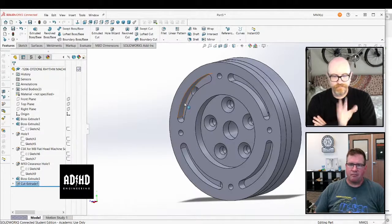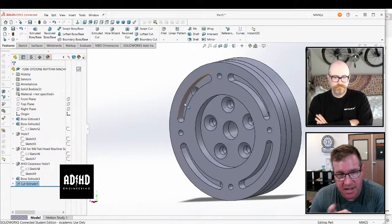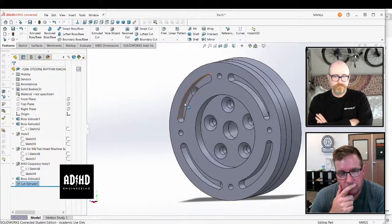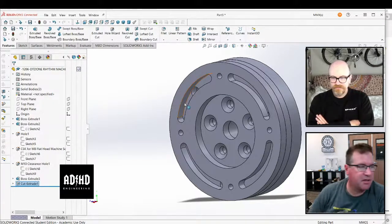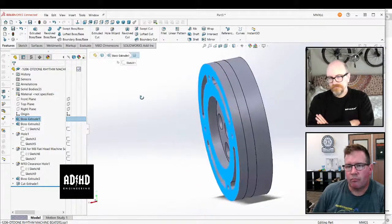Yeah, I already have 2 bodies in this part right now. Okay, yeah. So I was gonna say that's a separate issue, but yeah, I've realized I'm doing a multi-body part here. This needs to be an assembly. Yeah, this needs to be an assembly indeed. So I'm not going to save this. Okay, back up a second. Why does this need to be an assembly? Because each of these are individual parts, and they need to be saved separately.